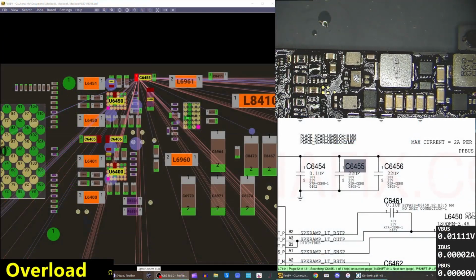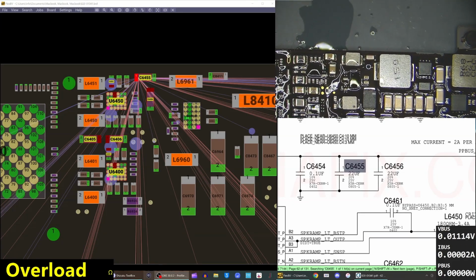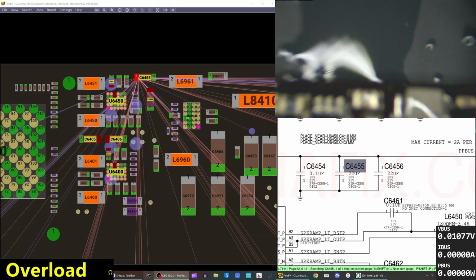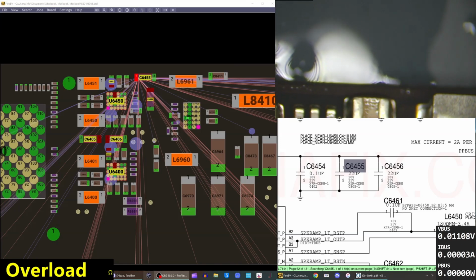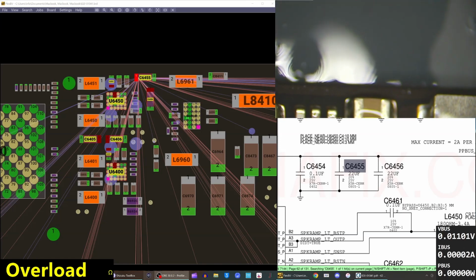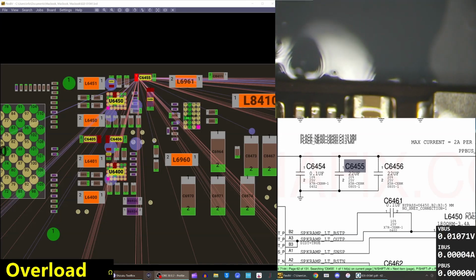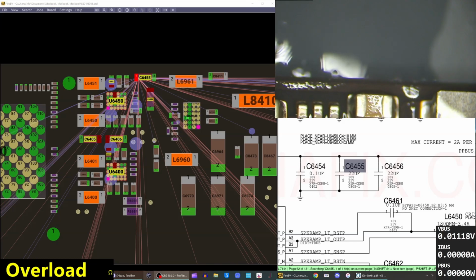This wire right here is masquerading as a capacitor. We already looked on the thermal camera, but you can also see this sort of stuff with isopropyl alcohol. Getting close on this guy. All right. Obviously, finding this without the thermal cam would be a lot harder, but we can see how quickly it evaporates this alcohol. That thing's getting, yeah, there we go. It sizzles it right off. So that's our bad boy. We're going to remove it and replace it. And we'll be back again.